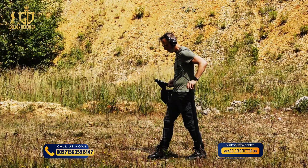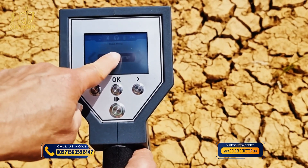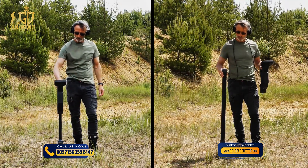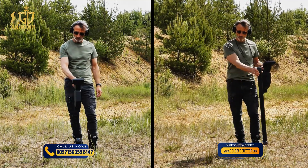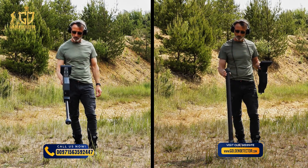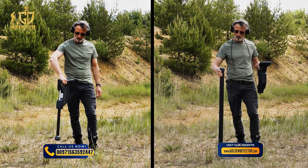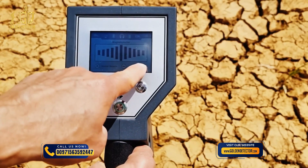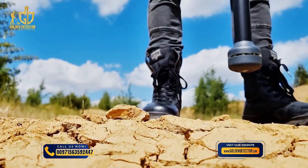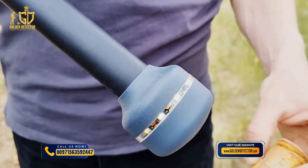By using the high resolution super sensor you can achieve a much better depth performance. Select magnetometer from the main menu and start the scan by pushing the start button. Move slowly forwards, backwards, to the left and to the right, but avoid turning the probe. The probe should always point vertical to the ground — do not pivot, swing, or turn it around its own axis. Switch on the LED orbit to get direct visual feedback. Ferromagnetic objects are indicated in blue and red colors corresponding to their negative and positive magnetic pole.